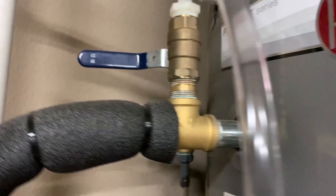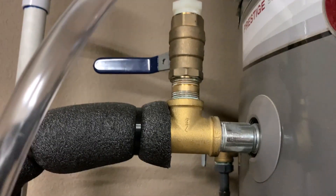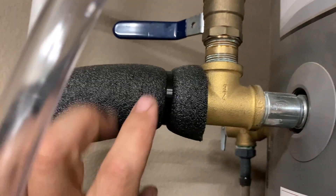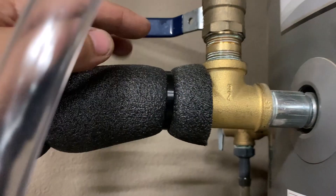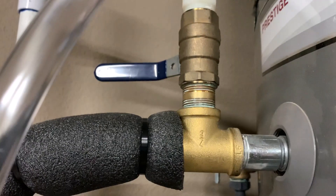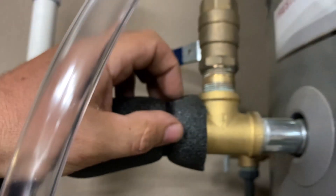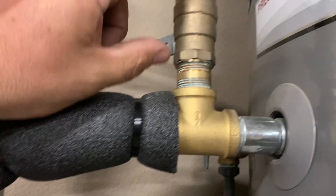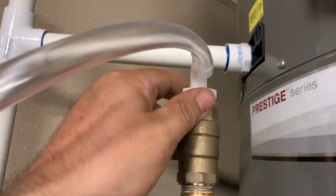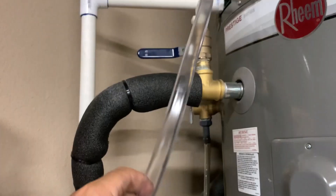It's pretty easy. All this stuff's available at a box store — Lowe's or Home Depot. All I had to do was disconnect the water line coming out through this hose here. I bought a tee fitting — make sure you get brass fittings without lead so they're suitable for drinking. I bought a little nipple adapter, a valve right here to turn on and off, another plastic adapter to get my plastic hose on, and now I've got a short foot-long piece of plastic hose.